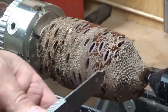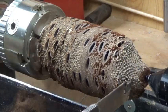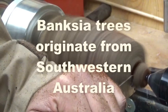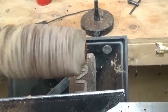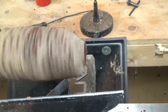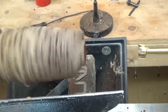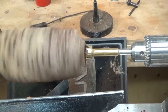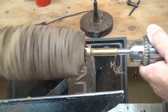With the Easy Wood parting tool I'm going to remove that tip because it's just too small to do anything with. With my speed down slow — about 350 RPM — I'm going to bring my tailstock up, lock it in place, and start drilling nice and slow.